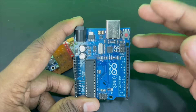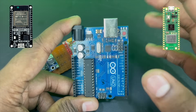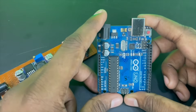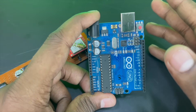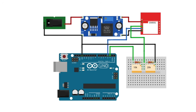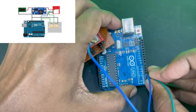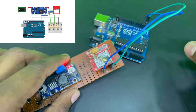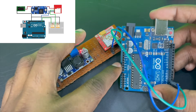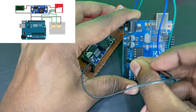If we had used another microcontroller like the ESP or Raspberry Pi, which has a 3.3V operating range similar to the GSM module, this would have been smoother. But I chose Arduino because it is mostly used by beginners and is commonly found. Here's the complete interfacing diagram for this circuit. While creating this circuit I made a mistake and initially forgot to connect the Arduino's ground with the circuit, which caused it not to work, but I later added it and it was working smoothly.